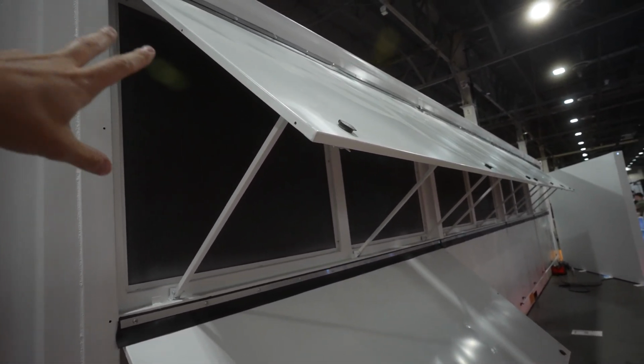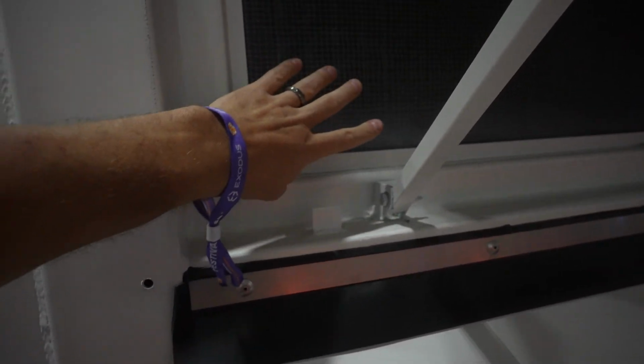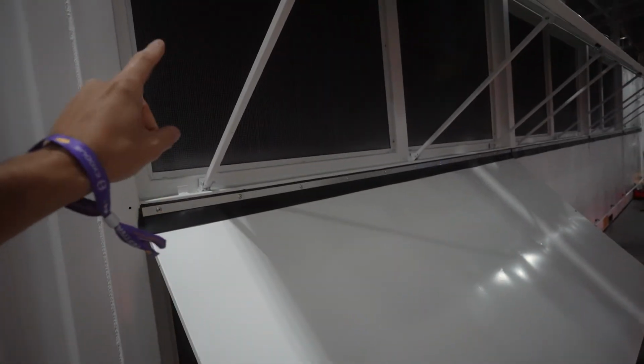From the outside you guys can see it's got these louvers or stilts or whatever to allow air to come in. The first thing I noticed, you are creating insufficient air because your filter is right here on the edge, which means that your volume is not as large. They should do an extension of the filter to come out more, but if you put in a thinner filter that would allow more air to travel through, then maybe it is okay. But looking at this filtration system here, it does not look like it is that thin. So first thing I'm going to say right away is that when temperatures outside will be 80, 90, or 100 degrees Fahrenheit, your miners in this container will overheat. They will not have enough air.